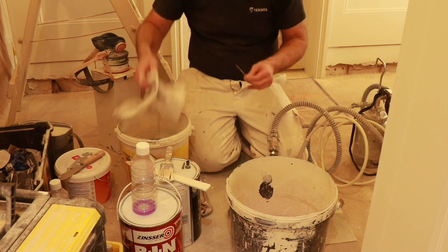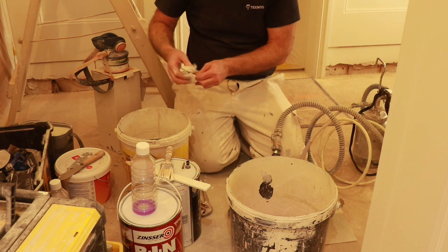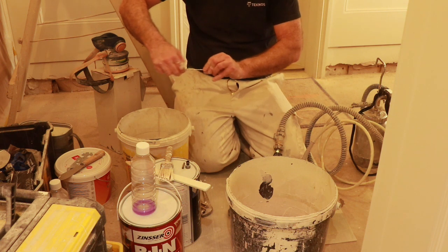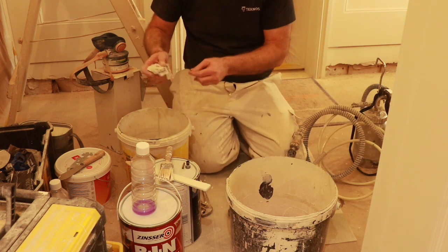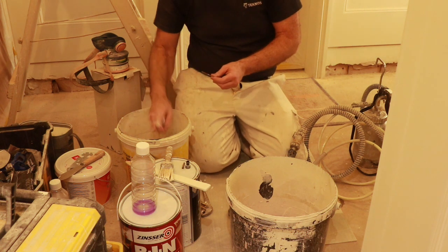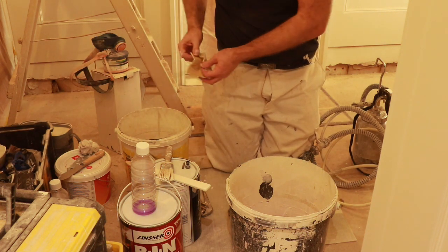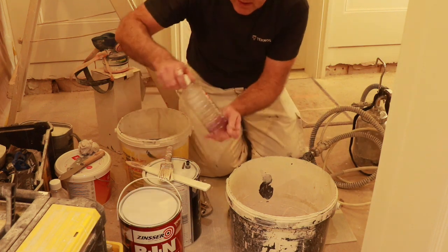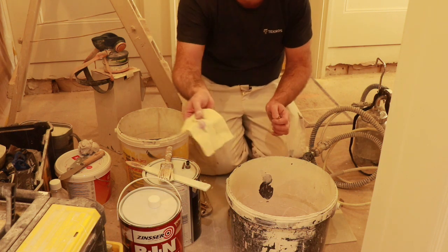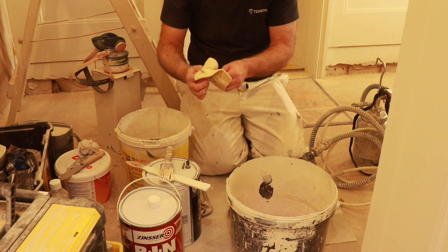Now, wipe that with a cloth and some water. Clean it down. If you've got a little scouring pad, and there's a bit of paint on it, you can scour it down. I think there still might be a little bit of BIN stuck to that. So what I'm going to do is, I've got a bit of sponge on the back of my sanding pad, bit of meth. The meth is on there, I'm just going to wipe that needle, get any last bit of BIN that might have been stuck on it. That's clean now.